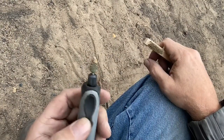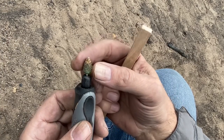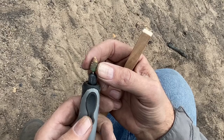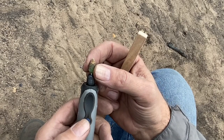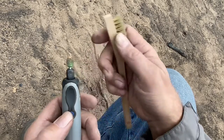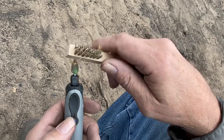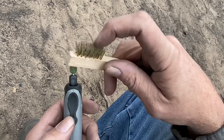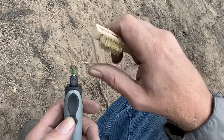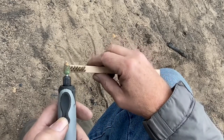Here's a saber bit that's kind of crudded up on the tip, and I'll show you how I clean them. Some people have different ideas — like Mike LaFleur said, soak them in some kind of solution, perhaps acetone or something like that. But I just use a brush, like a soft brass brush, so it doesn't wear down the bit, as opposed to a harsher steel brush. This is really soft and it's not damaging to your expensive bits.